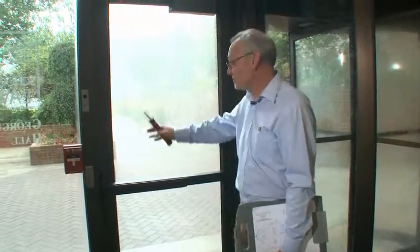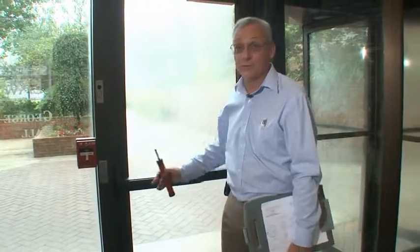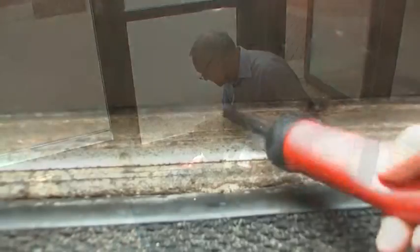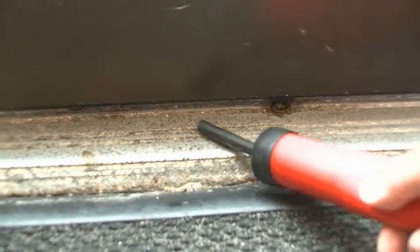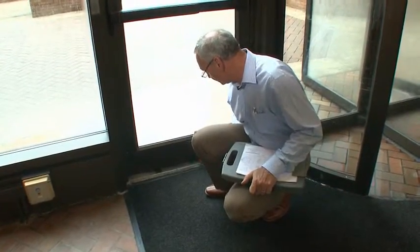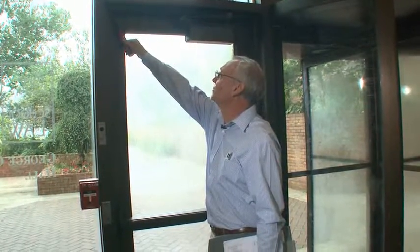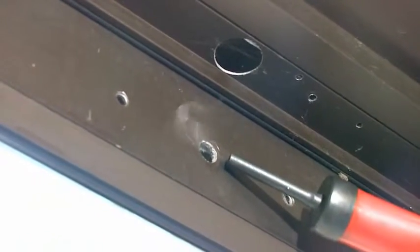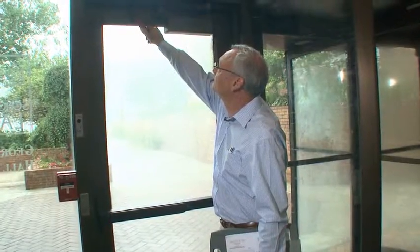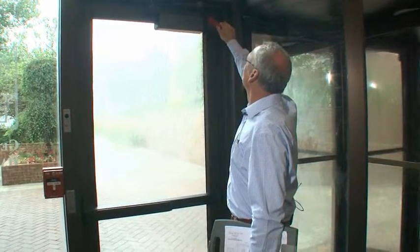We're at an entry door system — a commercial door that's mostly glass. There's some weatherstripping on here, but often it's degraded or absent — and you can tell there's nothing on there right now. Checking the bottom, you can actually see light underneath here. Since the building is pressurized with air conditioning, it's pushing smoke underneath the door. Testing the corners — the corners degrade — you can see the smoke going outside. Where they used to have a door opener, they left the holes, creating another air path. We also test at the top of the frame, the corners, and behind the holder.